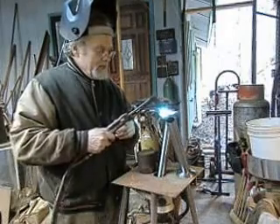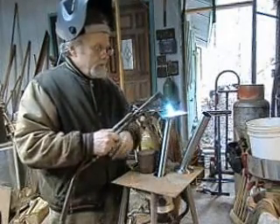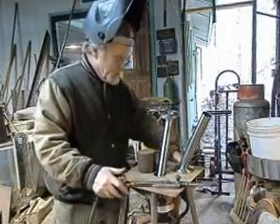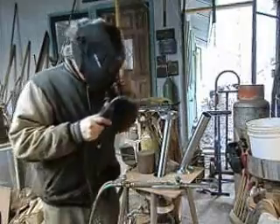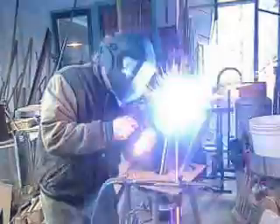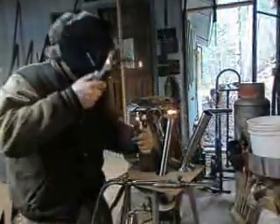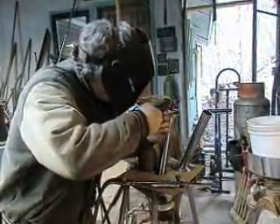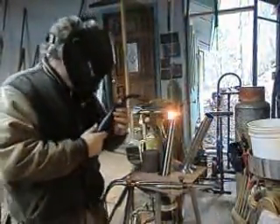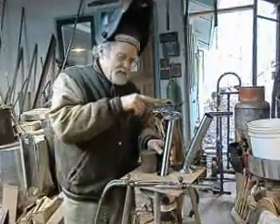So, a little preheating here — just enough to take it up to about 100 to a couple hundred degrees — and then come in with the welder.